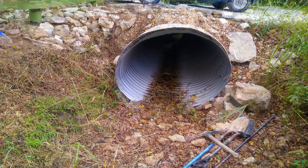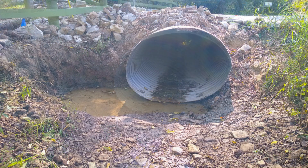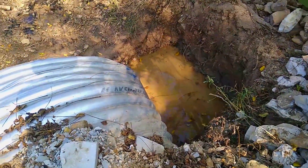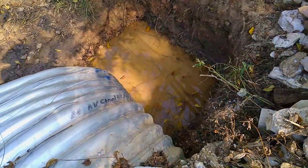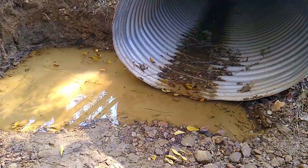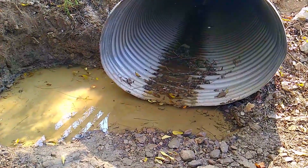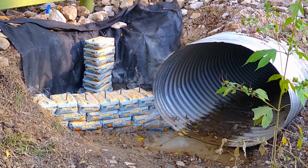This is how I built my culvert retaining wall. The first thing was putting in the key so that it would be well established in the ground, underneath the pipe, below the pipe level with concrete bags.